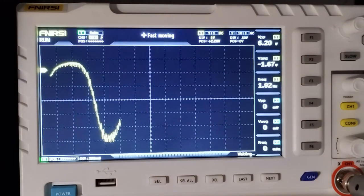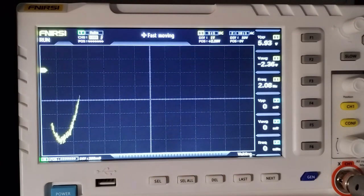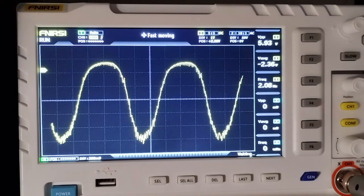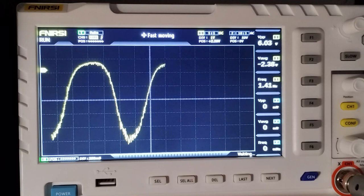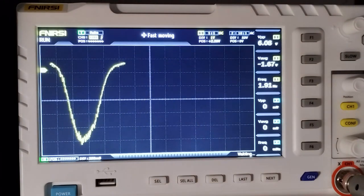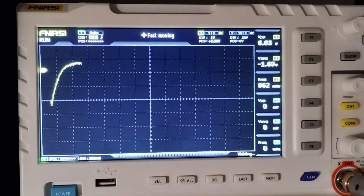After that, it would be possible to adjust the cores of the band selector, but with the IF chain aligned, the reception of the radio appears already very good in all bands, and it is judged safer to leave the band selector module alone.